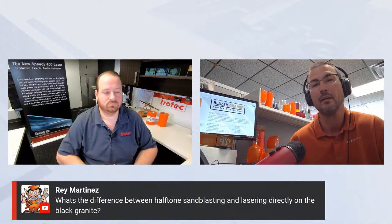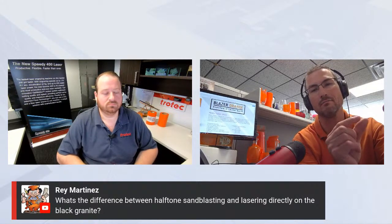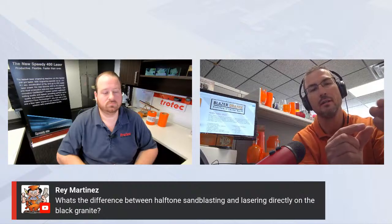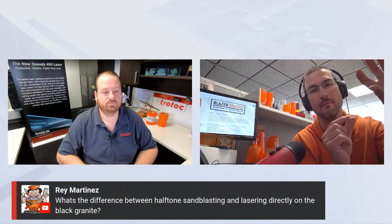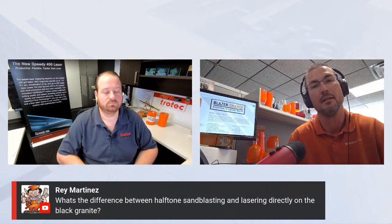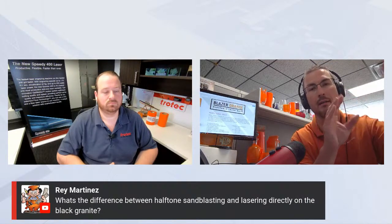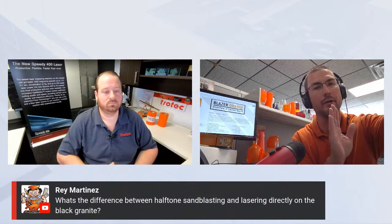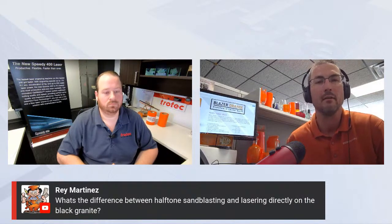I mentioned a little bit in the video, I was only 4 to 6 inches away. My beam of sand is about maybe a 1/4 inch. If I move my nozzle about a foot away and blast it at a higher PSI, my beam of sand would have been well over 1.5 inches. So you can just look at the time, the further you are away. A lot of my monument guys are like 2 or 3 feet away. They can blast a full 8 foot by 4 foot panel in minutes.